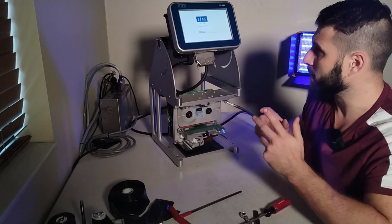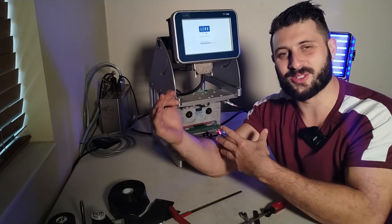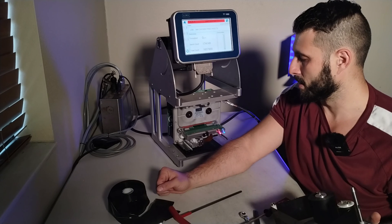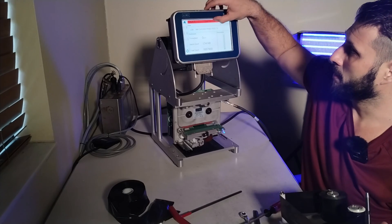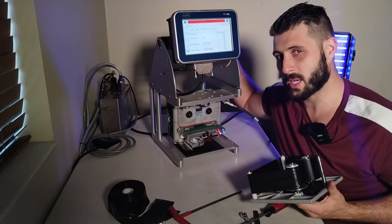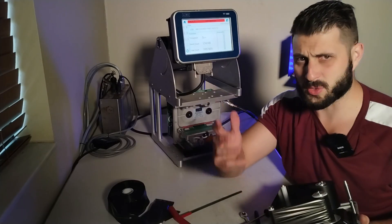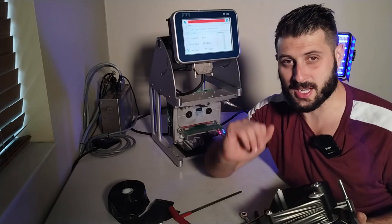Time to test — we've got our new ribbon detector PCB installed. What we're looking for is whether it really does flash like that. I don't see it flashing anymore, so I think we may have gotten it. So now, anytime this happens to you in the field and you see that detector strip flashing every two seconds or so, you know to check that emitter — the ribbon detector PCB.